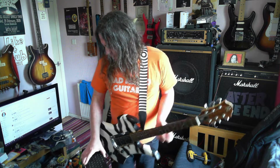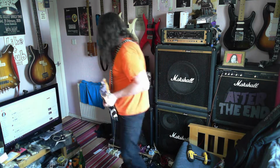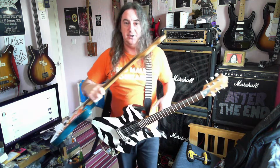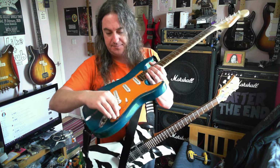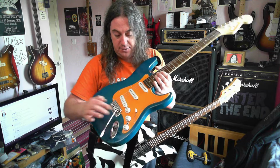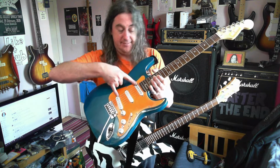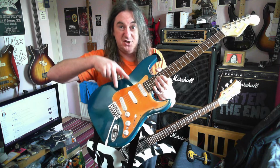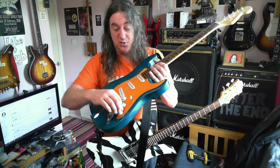I've thought up a switch for this guitar here, a Strat. I did an Affinity Strat I've actually got for sale just now that I'd invented a switch for. This one's got another type of switch in it. In the middle position, it's just a Strat. If you push it down, it adds in the bridge pickup, so you get the outside two like a Gilmour switch. And if you put it the other way, it wires these two as a humbucker, so you get an extra 4 sounds, so it's like a 9 sound thing with just one 3-way switch.